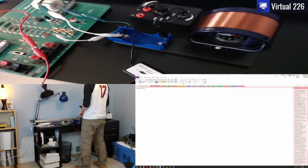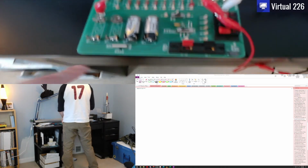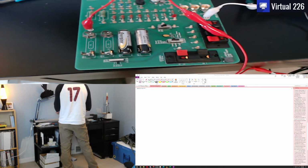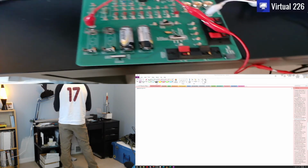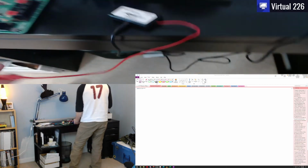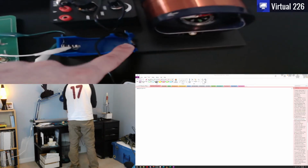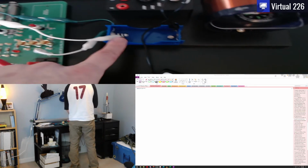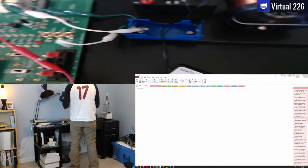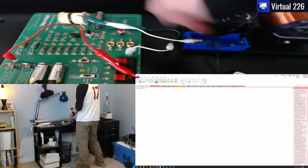The issue is that I don't have a D-cell battery, so what did I do? Well, I've got this Vernier circuit board 2, and I hooked up two AA batteries. AAs and D cells actually have the same voltage of 1.5 volts across them. I just want a little bit more oomph so we could see it, so I put in two batteries here. I went from the positive terminal and brought it out, and then we're going to need our current later, so I passed it through this Vernier current probe in series, because that's how you set up currents. Clipped it up to the positive end of the D-cell battery holder, rolled it over to the negative end, because that's how these are set up in the battery holder itself, and then rolled it to my negative terminal here so that we come home. So we set up the positive end, it runs through everything, kicks out the negative end, comes home, we're done.